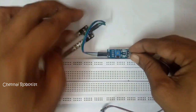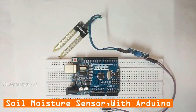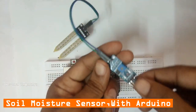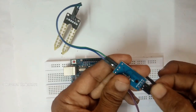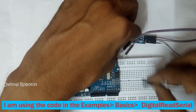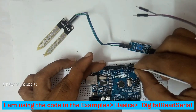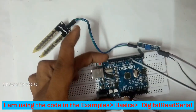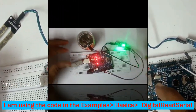Now we have the board here and we're going to bring in Arduino Uno. We need to connect two more pins on the board — there's a digital pin and an analog pin on the last terminal. Let's start with the digital. I'll connect the digital pin to Arduino digital pin 7, and then power the board with 5V and ground.